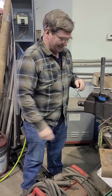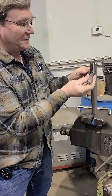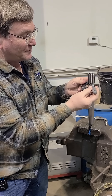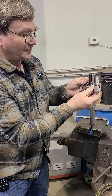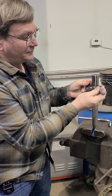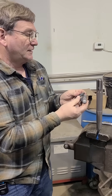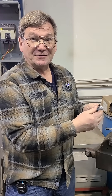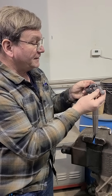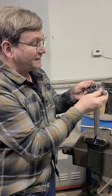We have a little problem today. We ordered a 32 millimeter carbide reamer, and it turns out it was a — in quotes — new surplus expansion reamer. The problem is if we come down here, we've got measurements at one and two, pretty close to just about 60, a little bit under, which would be slightly undersized for the 32 millimeter and would actually still work for what we're doing. But up at the big end, we're at one and 274.